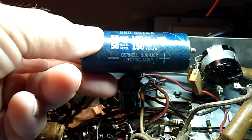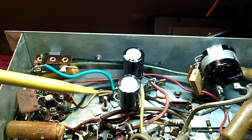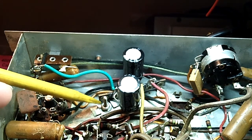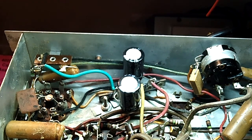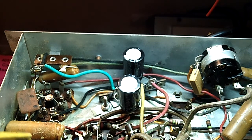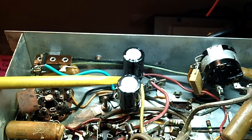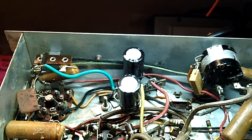This was the big old capacitor that was in there, and what I did was I put the terminal strip in through that hole, with a screw and nut, and then on the other end I soldered it right to the chassis itself, so this isn't going anywhere. I decided against putting the other 10 microfarad cap in - between these two, they're both 47 microfarads, so it's only 6 microfarads off. No big deal, it's going to be more than enough filtering.